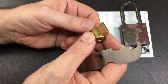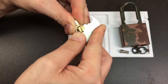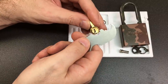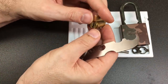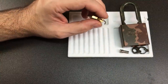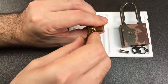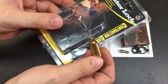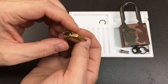Some of these Master Locks and American Locks have been crimped, so I'm glad this one isn't. Let's lock it back up, push this off, and try not to fling the circlip. The trick is not to push it off all the way otherwise you lose the follower. I've got a titanium follower that'll work. There we go - let's get that key in there. This is definitely a four-pin lock - not five pins. Unless this is the wrong box for the lock, but it clearly says five-pin.